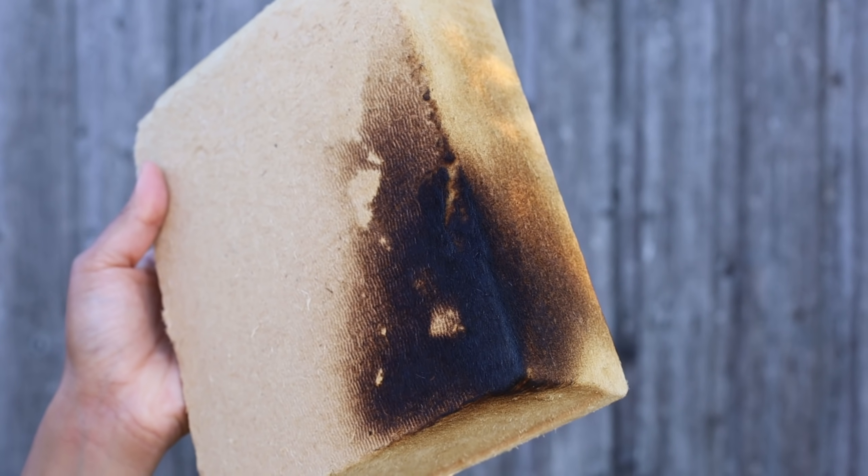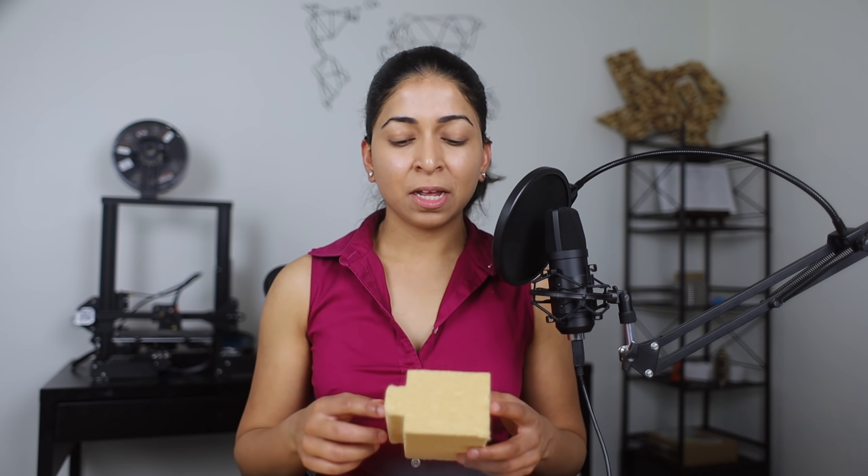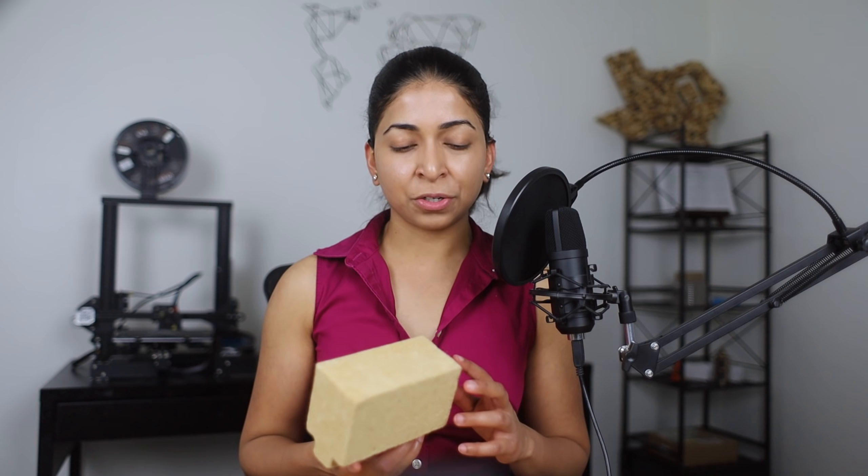The smell of burning wood brought back memories of the laser cutter in architecture school. This also has very good acoustic properties because of their high densities, open porosity, and tight tongue and groove joints. When installed properly, Gutex boards can reduce sound levels by 50 decibels. Wood fiber is a more effective sound barrier than foam, mineral wool, or fiberglass.